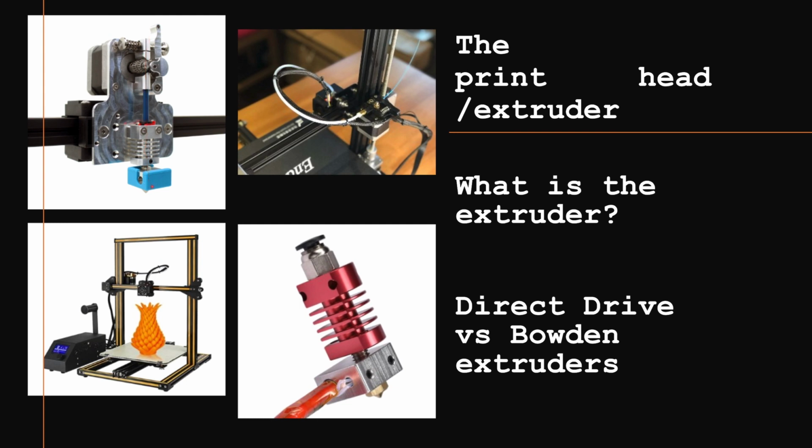which is why I use a direct drive extruder to print flexible filaments. And also, let's say the printer wants to print this, and it needs to travel from here to here without extruding any filament. So obviously the extruder motor would stop moving, because you don't want to extrude the filament. But there's still hot filament in here, and it will usually kind of seep out and come out, and then that will cause stringing, which is where filament gets extruded where it's not supposed to be extruded.